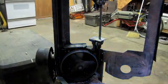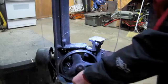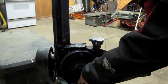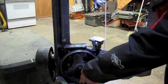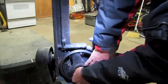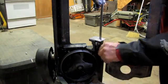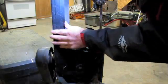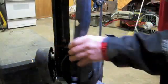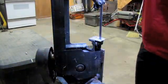All these saws are a little bit different. The addition of that little roller makes life a lot nicer if you've got one of these saws, because they all do this. I have one — it does it. This one does it. And the one in the other room, the Jet, does it. I took the screw out of here and it was bent. You bend these things just to give it a little profile so these dimples bite on there, and it's not going to pop open on you.